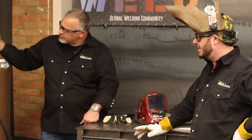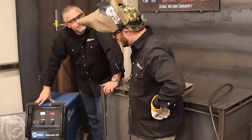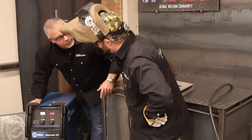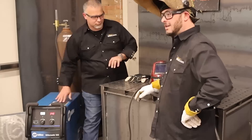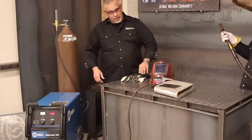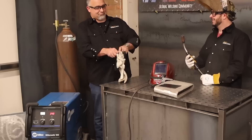Let's give it a shot. How the heck are we going to set our voltage for this? We've got to get our gas turned on — we've got our gas flowing. We're going to turn our machine on. How would you normally TIG weld? I would set my amperage. We don't have that option — we've got a wire feed and a voltage. Let's set our voltage, starting around 23.5 volts, and see what happens. We're trying new things. We'll notice this move a little bit as we get welding, and we'll adjust as we go. We've got to check our flow rate — yeah, we've got flow. We're running a three-quarter inch nozzle, which would be a number 12 cup for TIG.